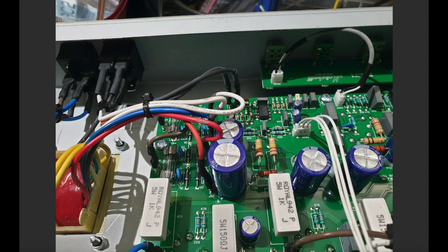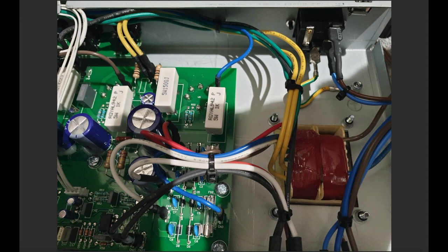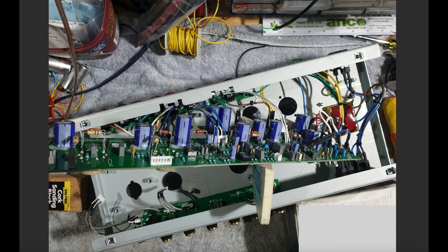These are the cathode resistors here, actually, these big 150 ohm 5 watt resistors. So let's continue on. That's just more stock photos, and this is how you can mod it. You don't have to pull the whole board out on this. With the Origin 20 mod, if you've had a look at that, I had to pull the whole board out because you really have to get right underneath it. What I found with the Studio Classic is that you've got to unscrew a bunch of bolts that bolt this to the chassis. You've got to unscrew the retainers on the power tube sockets from the other side of the chassis, so on the top side, you unscrew all that, and then the single lift out.